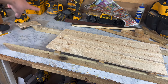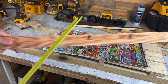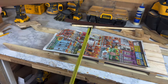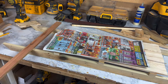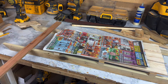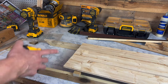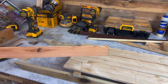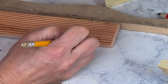If you're actually sledding, it's the part you would steer. And then I also have to be mindful because at the top there's going to be a rope. I think this is the board I had slated for that. This piece just happens to be about an inch and five-eighths in width and about a half inch in depth. The length doesn't matter because I'm going to cut that off, and then I'm going to use my bandsaw and cut out the curvature on that. Four and a half looks about the right proportion, so this board needs to be 21 inches long — it's four and a half inches overhang and the body is 12 inches. I'm going to cut this piece at 21, and then do the little curve on that side and turn it over and do the same on the other.